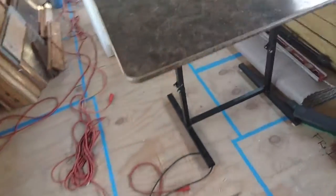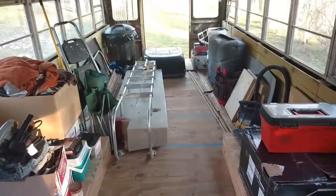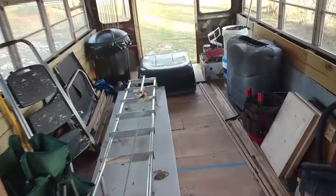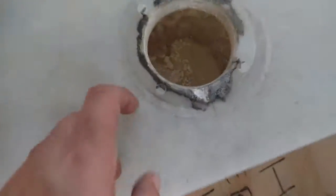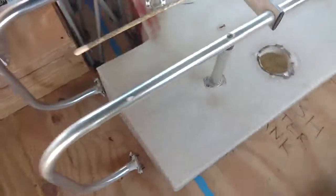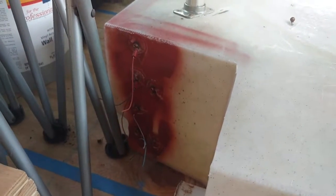A lot of this little stuff they threw in for free, so that's a blessing. We've got a water tank under there — looks like it was gray water, mostly lime and a little bit of silt buildup. I'll clean that out with bleach and let it soak. I need to find plugs for it. This will be our gray water tank. It looks like it's got electrodes on it for a 120-volt heater that will keep it from freezing, so I'll probably get a heating strip for that.